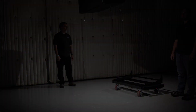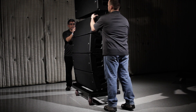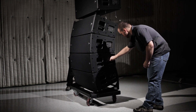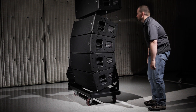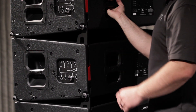To attach another stack, roll it into position underneath the suspended array, and if you haven't selected angles, preset the angles with the QRPs along the sides. Note that for the flatter top sections of long arrays, the suspension hardware can be pre-engaged to make connection between blocks of four easier.